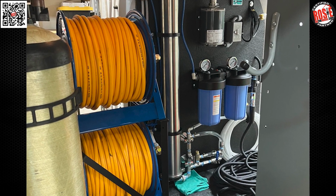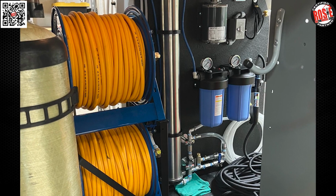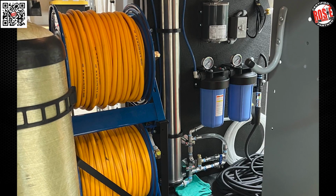Agitate and scrub each grout line that you need, and then we're going to use a spinner tool, which is going to get rid of that dirt that can get in there really good. And then we seal it afterwards, which is a key thing to do, just to prevent it. If you spill a soda, or get some tomato sauce in the kitchen, it's going to get into those grout lines and stain them. So you've got to make sure you protect them so you can clean it up.